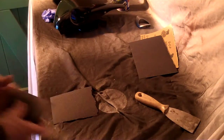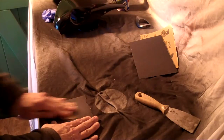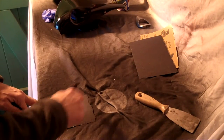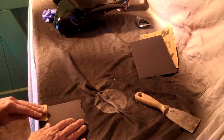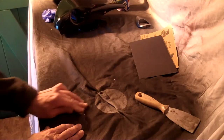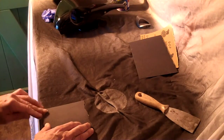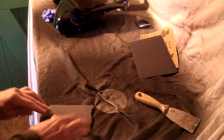As an example — just lay the paper out and sand it down against itself. It's still perfectly serviceable for wet and dry, but it's a lot finer. A trick to make sure it's nice and even: you don't want a really gritty patch that's going to leave any lines, so take your time. You don't have to rub hard or lean on it — you'll just kill it altogether and waste it. That makes a lovely fine paper.